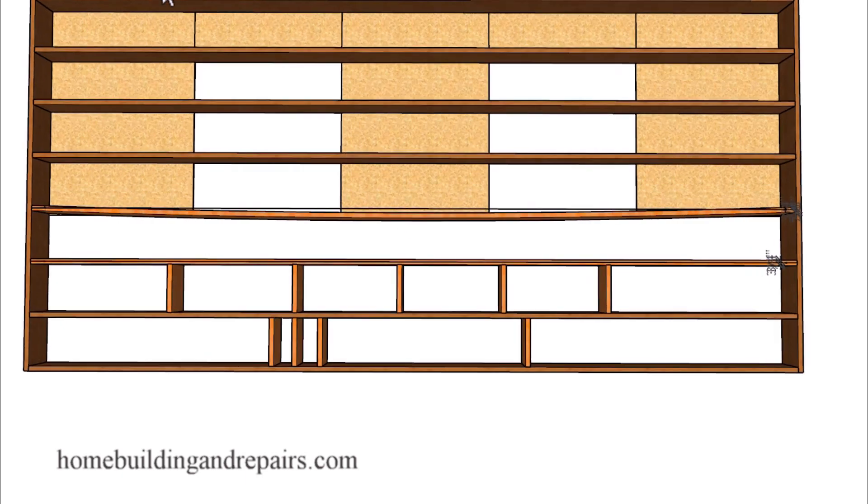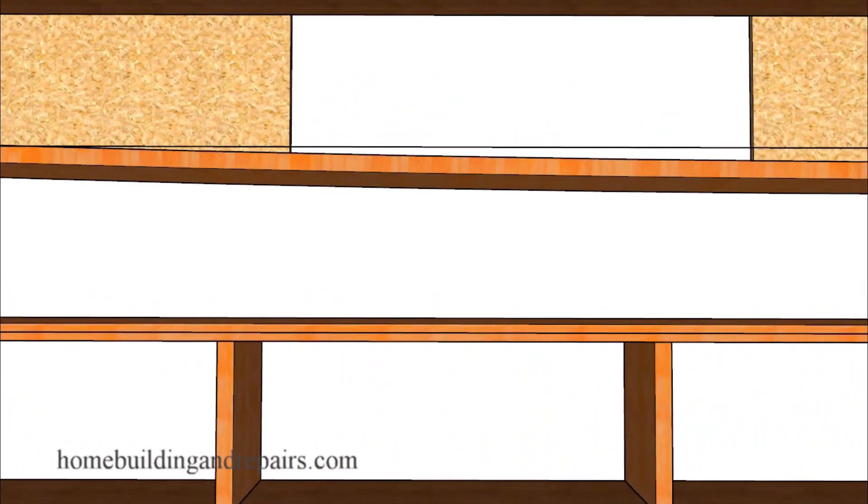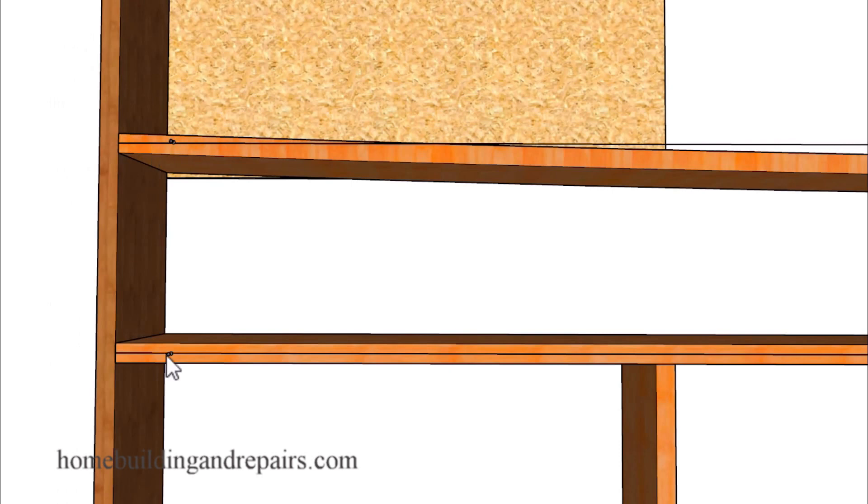Let's zoom in here. I have a straight string located in the center of one joist, but over here I do not. You might need to adjust the joist in sections, which may require multiple blocks, or position the joist and then nail the sheathing from above to prevent it from moving — otherwise the joist is going to be off a little bit. Once I've straightened one joist, I can simply measure from that joist to either the center or the side to cut blocks to straighten the next joist or even the next few joists.